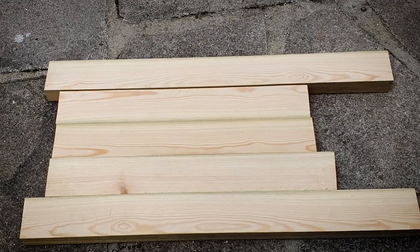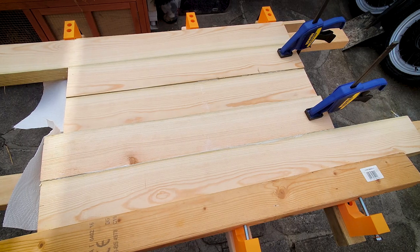With all the CNC files completed and output ready, it's time to assemble the blank. I'm probably going to make the final bass out of either alder or ash, but those materials are quite expensive in my location, so I used some softwood to make up a blank inexpensively to test the CNC tool paths — if it ruins it, it's not a particularly expensive endeavor. I realized I didn't have enough material to make a full-width blank, so I ended up using some OSB as well, which gives it a cool look but is less than ideal. Once glued up I used a makeshift clamping system to bond it all together. The purpose of this is not to be structurally sound — it just needs to survive the CNC operation so we can verify whether the tool paths are successful.